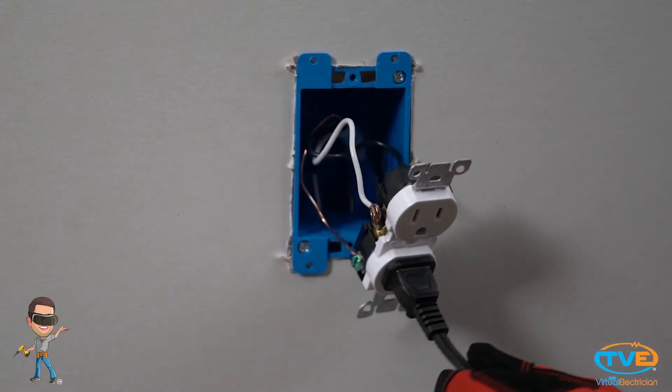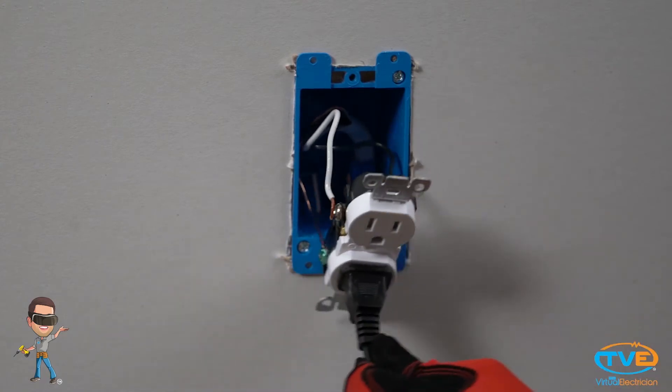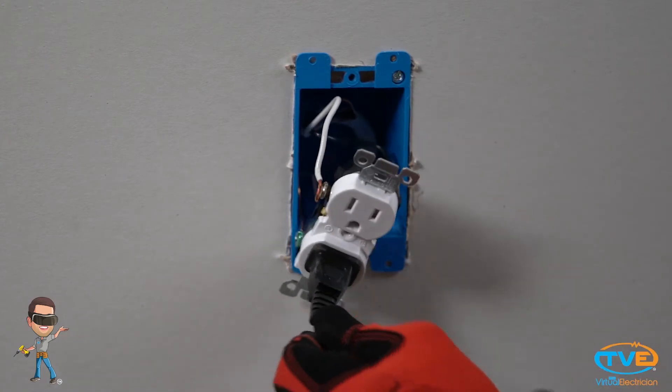The difference between an arc fault breaker and a regular breaker is that a regular breaker will trip if it detects heat or an overload at the panel box. An arc fault breaker will trip if there is heat or arcing downstream from the panel. If you have an outlet that has a loose connection, it may cause some arcing. This arc may not be strong enough to trip a regular breaker, but it's causing plenty of damage at the outlet and is a fire hazard.